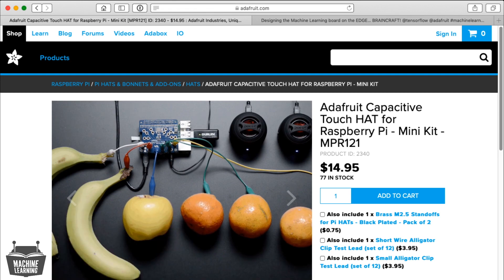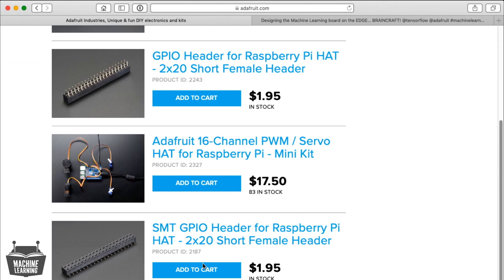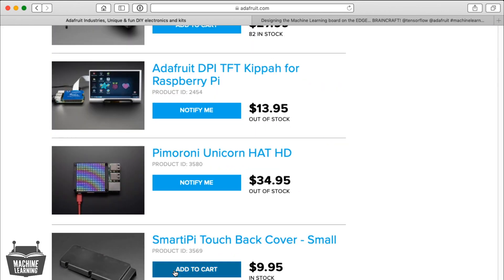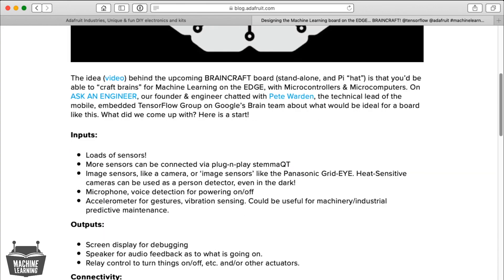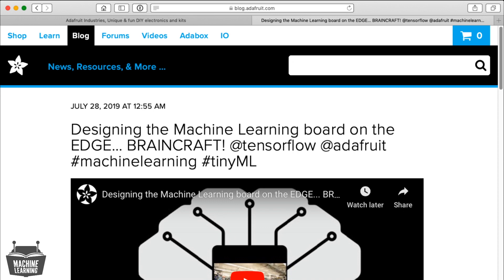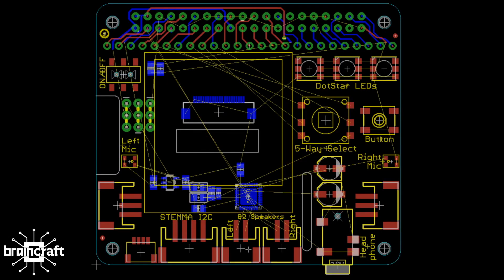I wanted to make one that makes it easy to do machine learning AI projects. Out of all the hats, a machine learning hat is a good idea. And a Raspberry Pi hat can run TensorFlow — proper TensorFlow Lite on a Raspberry Pi, especially the Pi 4 computer, or the NVIDIA Jetson or the Coral board. There are a couple different boards that are good at inference or even training on the edge. So I thought, let's make a hat with that standard size. The Coral board and the NVIDIA board have basically the same pinouts. So this is the board I just started — I spent about a half hour on it and I'm not done routing yet.